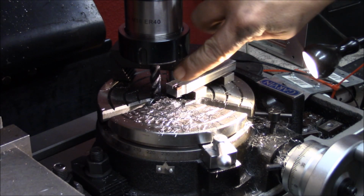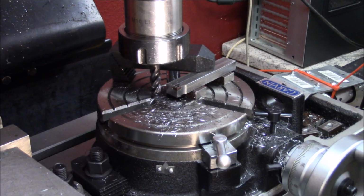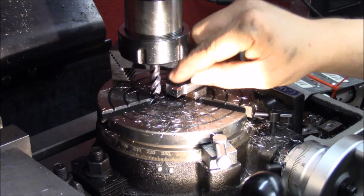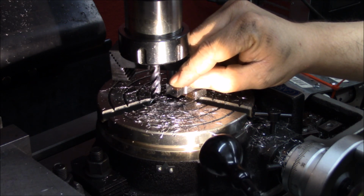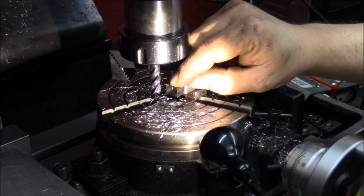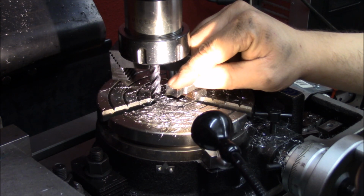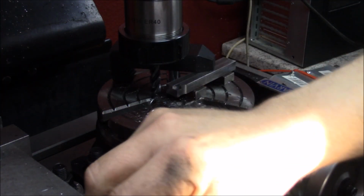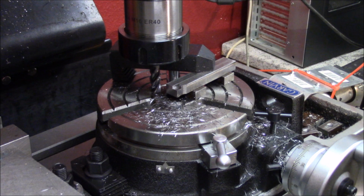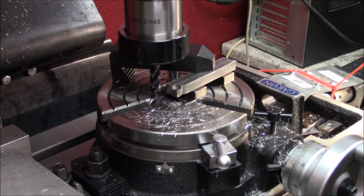the tip is, I think, flush with the end. Let's try. No, we have to go a little more. Oh, it is a tenth of a millimeter more. So we will go X, 1.1. That's it. Then we will give it one more go.